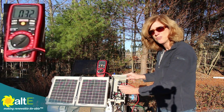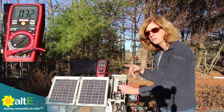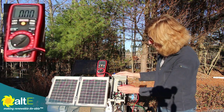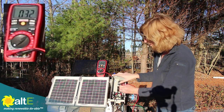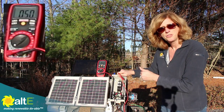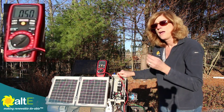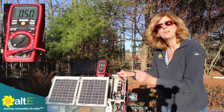This is really nice — if you're not getting what you expect from your solar panels, this is a great way to test where your problem is. Turn your breakers off, put your multimeter on amps and test each panel. I'm able to see that the one at 0.17 amps is my bad panel. Now if I've got 0.17 on one and 0.32 on the other, when I turn on my breakers and go to my combined output — combining the positives — I'm at 0.5 amps. So it has added the current together of the two solar panels.